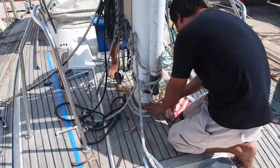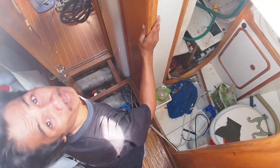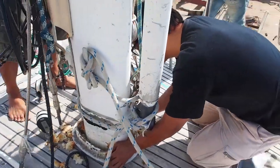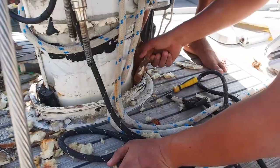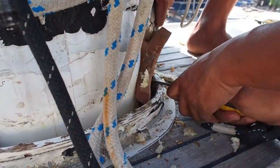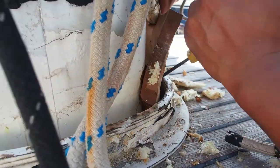Because the mainmast is mounted through the hull, our carpenter Tom is tasked with ensuring the electrical cables for the navigation lights don't get caught when the mast is lifted. Two rubber wedges, used to prevent the mast from moving when in position, have to be removed before the mast is hoisted.